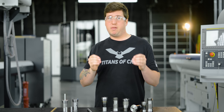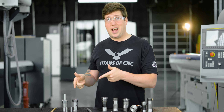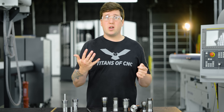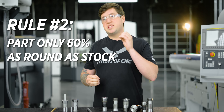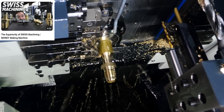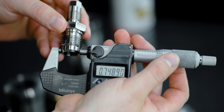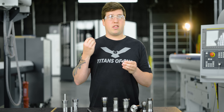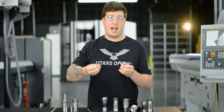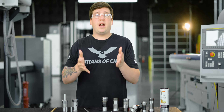There are two rules people typically tell you when running material on your Swiss machine. Rule number one is that your material has to be within a thousandth of your guide bushing. I just showed you that's not true — on that bone screw video, the material was five thousandths oversized and it ran absolutely fine. Stop letting people lie to you. Rule number two is that your part can only come out 60% as round as your stock. Well, if you watched our aerospace video, this part actually came out round within a tenth — the material was two thousandths oversized and two thousandths out of round. Depending on your tool pressure and how sharp your tool is, you can achieve a rounder part. There are tricks to all this, and I don't want you to think there are specific rules you have to stick to every time, because it's going to cost you a lot of money.